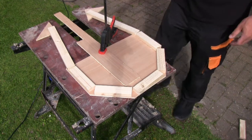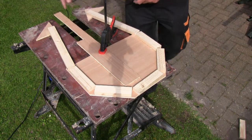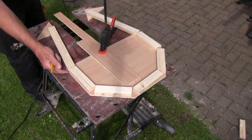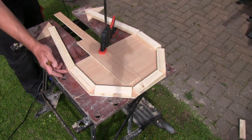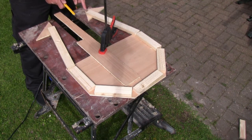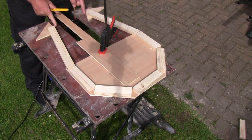So next thing we want to do is to place our 35 centimetre pieces. We've got 2 of those, and angle them in. Basically how we build this is any corner is flush with the piece of wood below. So that corner is flush with the base plate, and then we angle it so that our centre line, if you're using this dimension wood, is 10 centimetres either side, so you should have a 20 centimetre gap.